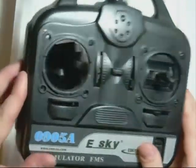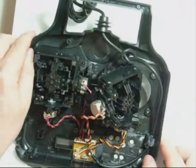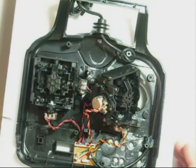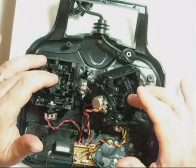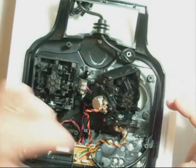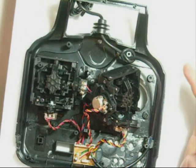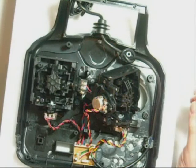When we do this, you'll see that the stick will fall away from the front. That's okay. Just make sure when we turn it over we don't drop it so much that we break the wires. This is a very simple device — it's basically a very simple USB joystick chip connected to four potentiometers. You can even wire more wires up to this. You can get some buttons added to it if you want to. If you go into Windows, you'll notice that when you calibrate the device, it has four axes as well as another axis which is not used and three buttons provided by the chip which are also not used. So if you have the nerve to do it, you can easily wire up your own switches to do things like throttle poles, for example, for 3D choppers.